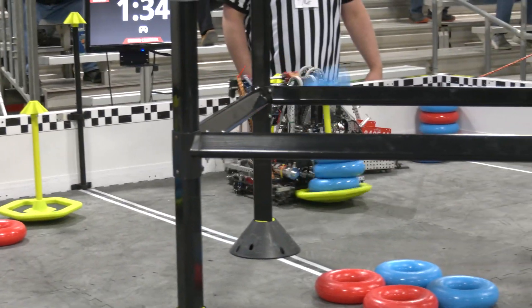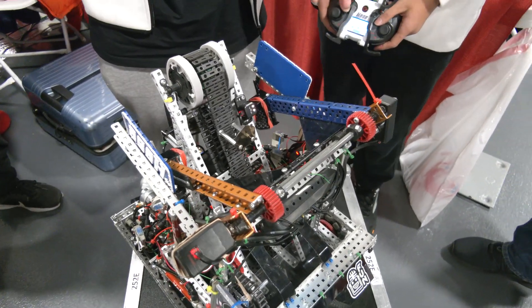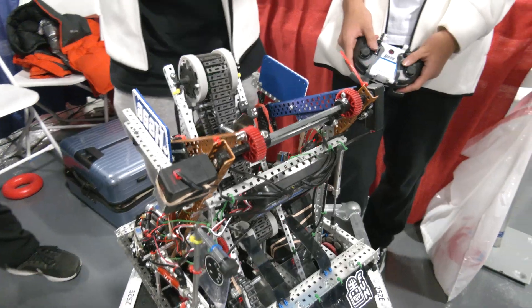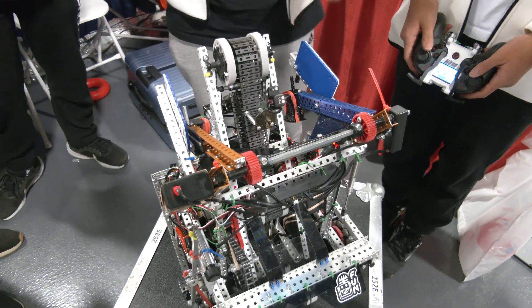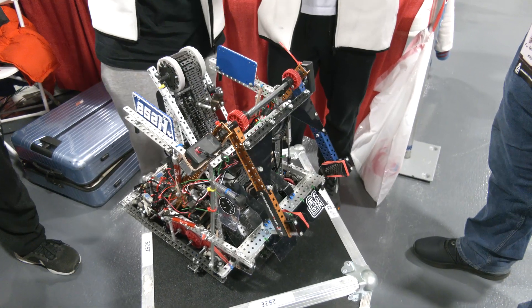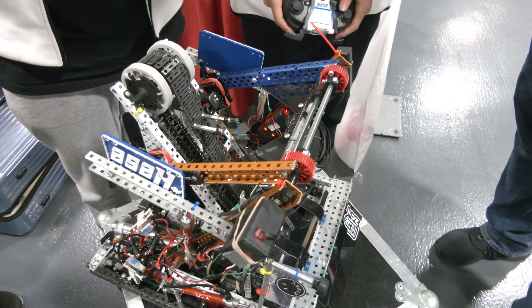Henry, let's talk about that second stage with the hooks, and also the changes from the standard Lady Brown. So our hooks in the first stage of our intake run at 600 RPM because we want the fastest cycle time possible. Our bottom flex wheels are the two-inch ones and our top flex wheels are the three-inch ones — with less torque, the smaller diameter gives you a more violent flip, but you lose torque. So we decided to use the three-inch wheels for a cleaner flip on the ring and better scoring. Most teams now are using a standard Lady Brown arm, but what makes this arm different is that it can go 360 degrees without going out of size. This allows you to pull mobile goals out of positive corners if the team isn't holding it properly. With the triangle aligners we have, they allow us to pull the top ring off of any MOGO just by putting the arm up and pulling the MOGO back.